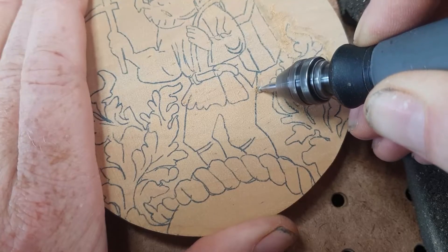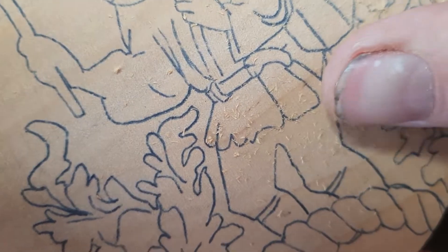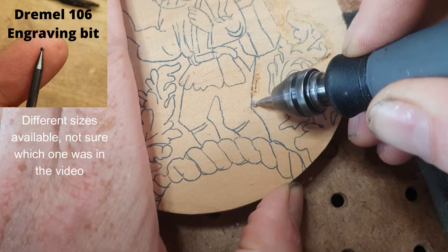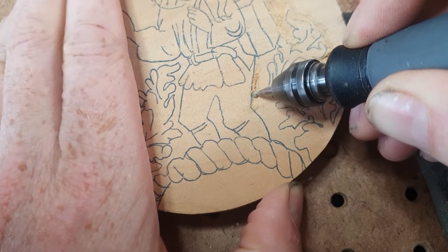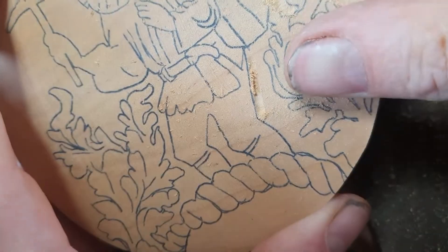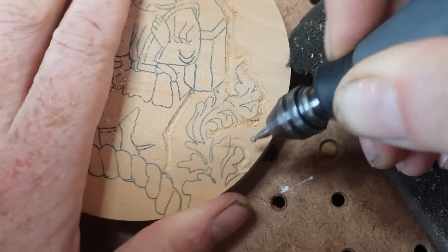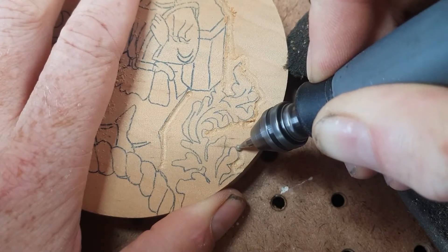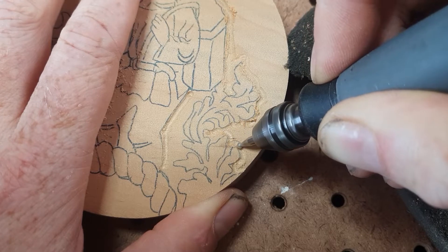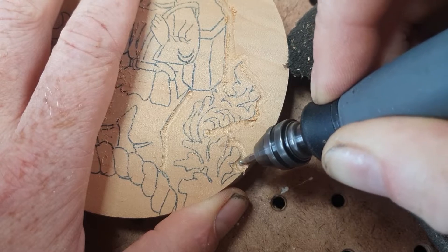I'm cutting with a cutter burr there, a small sphere one from Dremel. I want you to notice there's quite a lot of fuzz coming off one side, but you would have noticed I was going down with the Dremel. Now I'm going to go up and you can actually see that that fuzz isn't appearing. So I want you to be just aware when you start out carving — go into the carving with an experimental attitude to it. Try out different burrs, see which ones work the best, see which way carving is best as well, especially with these relief carvings. Sometimes the cutter burrs work really well, sometimes the diamond burrs work really well. It all depends on the wood that you are carving.